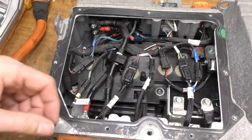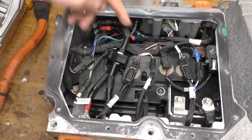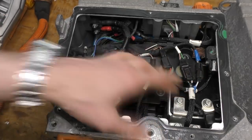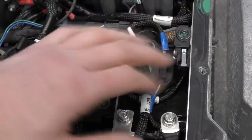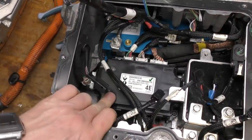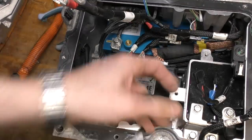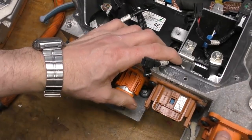Opening the first cover, there's not a huge amount to see yet. All these connectors are the interlock pins for the various high voltage connectors, all going down to one loom. There's a plastic support holding lots together and a big encased unit I think might be an inductor. They've actually got an interlock switch on the cover, so they're quite serious about safety interlocks. Removing this mounting plate, there's a 300 microfarad capacitor — three 100 microfarad caps — which is probably the input capacitor we saw on the patent drawing.